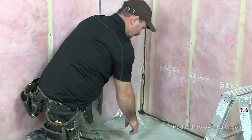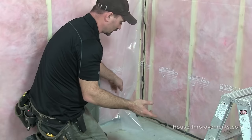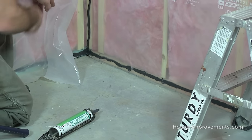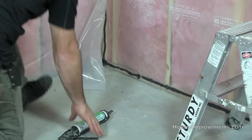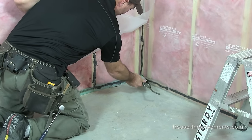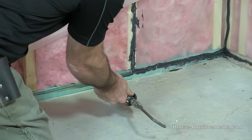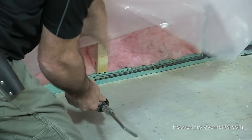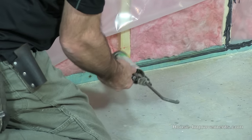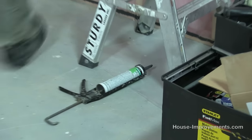When you go across the floor, if you didn't seal your bottom plate — whether to concrete or to wood — you'd want to run that bead of acoustical right down in the corner to seal that joint. In this case we've got the plate sealed already, so I just need to get this on the plate itself. If your plate wasn't sealed, you'd be right down in that corner. Always have a scrap of poly to lay that caulk gun on so it's not dripping on your floor and you don't walk in it.